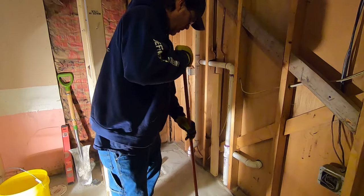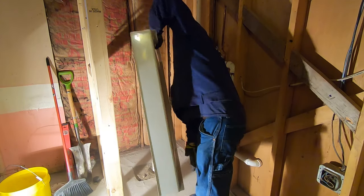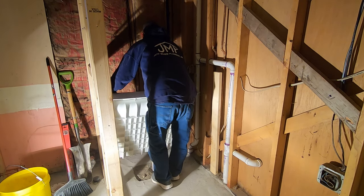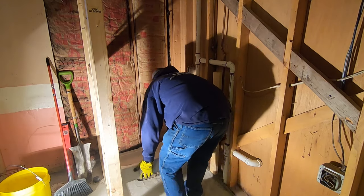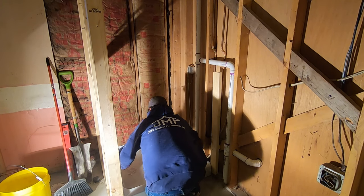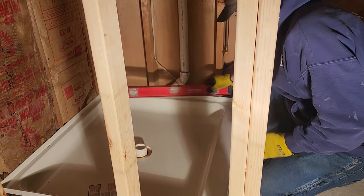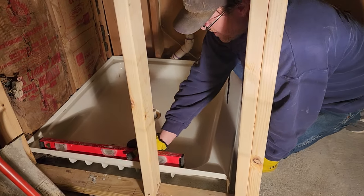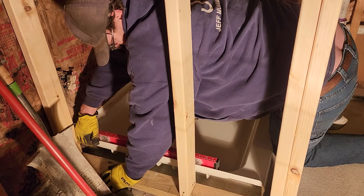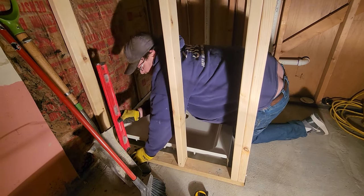You can see we've got some other plumbing in the walls — there are a couple sinks on the other side of that wall. This is a small motel just outside of Omaha, so they do not require cast iron. What Mike's going to do here is just kind of do a little test run. These walls were framed and if done correctly everything should fit, but you always want to set the shower base first on the floor. You're dealing with concrete, so nothing's ever level — put your level all the way around it, using a two-foot or four-foot level.